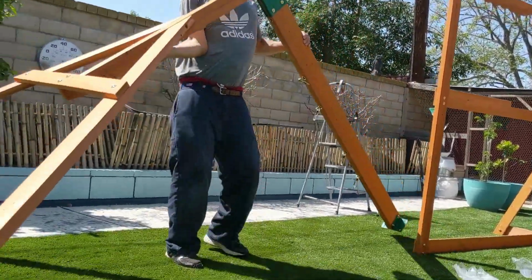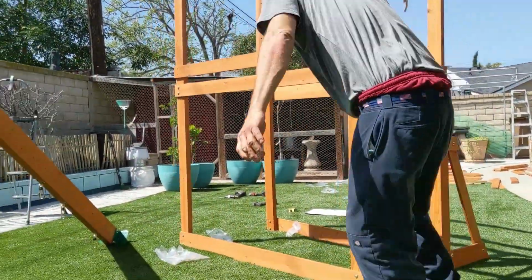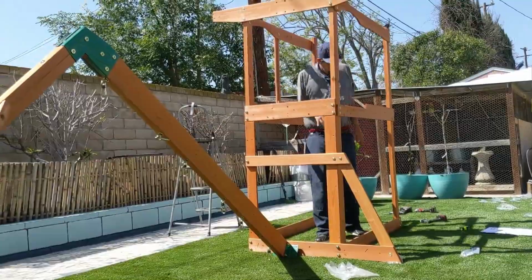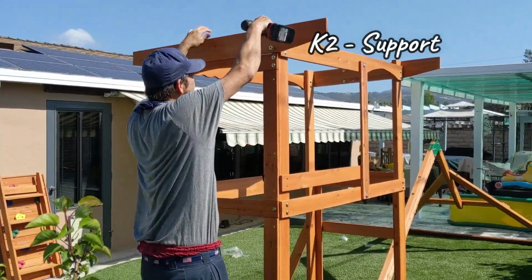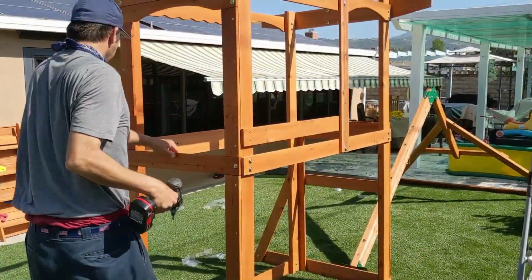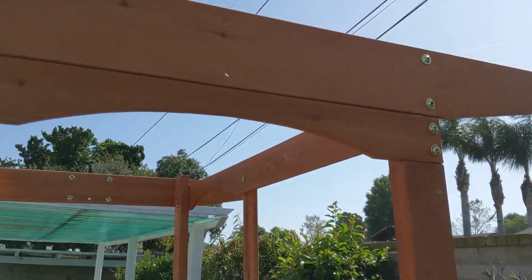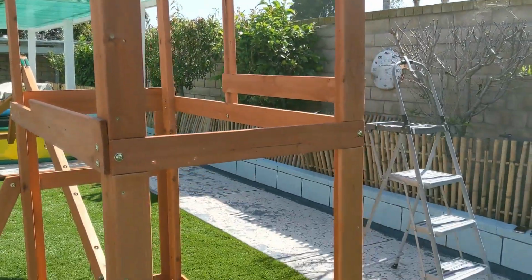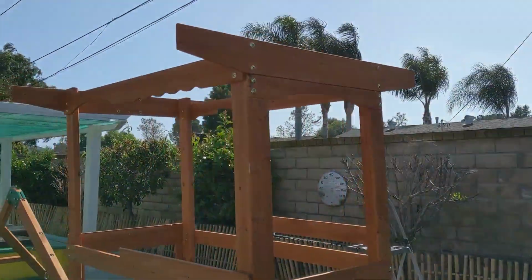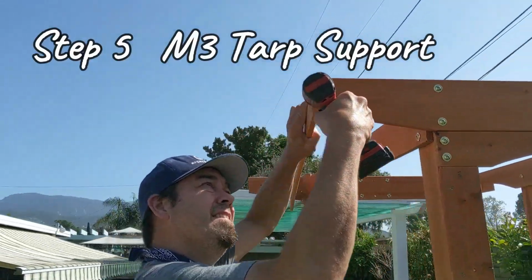And here's your swing beam, swinging it to where they want it, where they want their swings to be, right there in that location. So swinging this around, now that it's built, it's easier to deal with, and just lining that up so that that support beam on top lines up with the swing beam with those 4 little T-nuts. And off to the other side, put the other support beam on top, and that should have 2 holes in the middle, whereas you see the one across on the other side has 4, and the holes in the middle, those 4 shining T-nuts, are the back end of that swing beam. It's going to attach. I could either attach it now or attach it later. Somewhere along the lines I eventually attach it. So there's your tower, box built, and now you can just add to it.